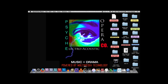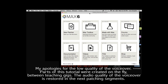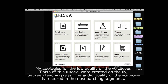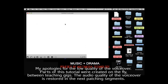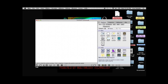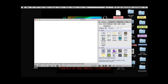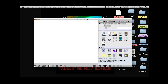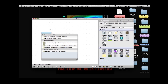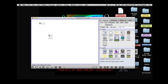Okay, I'm going to open up Max. I own Max 6. If you go into Cycling74 and download a trial or a subscription of Max, you'll be working with Max 7. The interface looks a little bit different, but all the objects that I will be using are available in Max 7. This is the canvas where you put together your software. While you're editing, make sure that the lock at the bottom of your screen is unlocked. When you want to test your patch or run it, you lock your patch and then see if your patch works. The first thing I'm going to do is bring in a key object. This will read my ASCII messages from the Makey Makey.